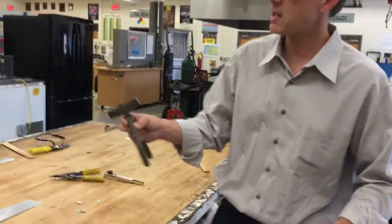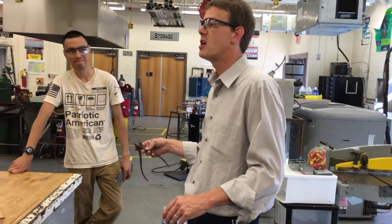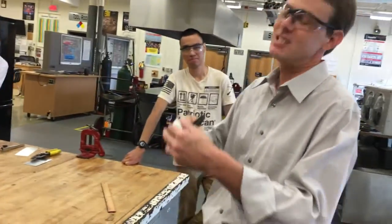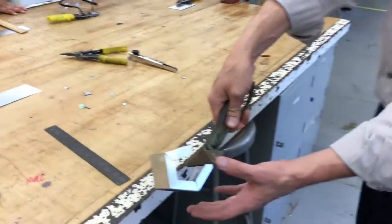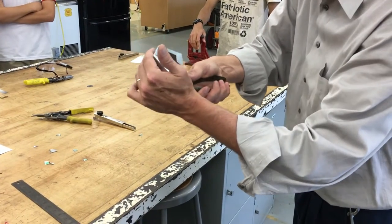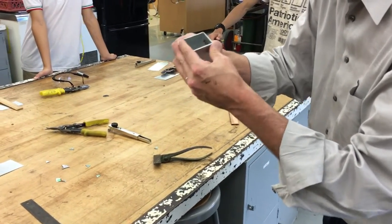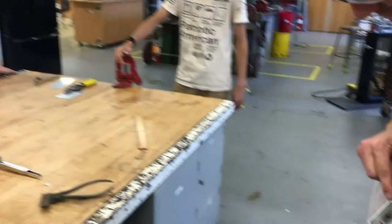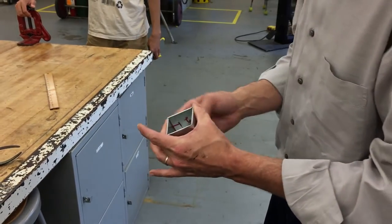Then the last part I can bend together with my hand, but I've got to use this last tool over here — and that's going to be these tongs. Cisco made a song about it — the thong song — or as I call it, the tong song. So you take the tongs, line up your line right there on the edge, make sure you're not folding up over onto yourself. Once you get your line lined up, take the palm of your hand and break the metal into 90 degrees. Then this piece will actually slide up underneath that hem a little bit and you can fold it together. If all your measurements were right on — mine looks about a sixteenth off — so we're not a perfect square but that's pretty close. You'll actually get two times to make it because it takes a couple tries before you can master it.